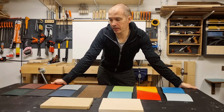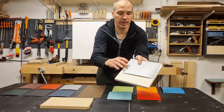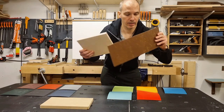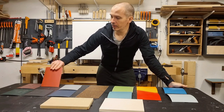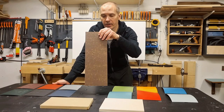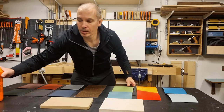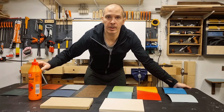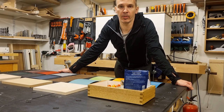You work with these materials pretty much the same way. You glue them onto a stable carrier — plywood, MDF, or any other sheet goods. You apply your visible laminate or linoleum on one side and backer material on the back side. It's really important that you laminate both sides of the product to prevent warping. It's not recommended to apply these materials to solid wood, because you don't let the wood move and the result can be warping, cupping, or cracking.